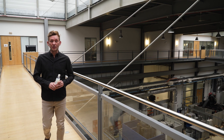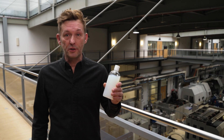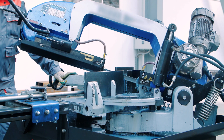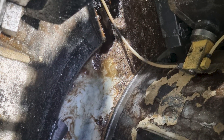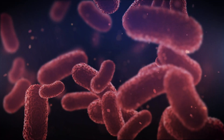The metalworking fluid in your machine is made from a concentrated solution that needs to be diluted before use. It's important to maintain the concentration at the optimum level recommended by your fluid supplier. Over time, the concentration can change due to the evaporation of water. This affects the quality of lubrication and could cause some metal parts to corrode, and may also promote the growth of bacteria, presenting risks to health.